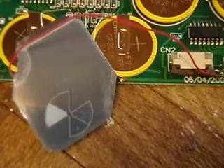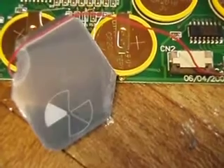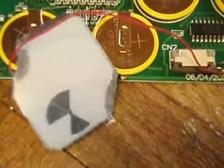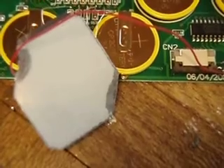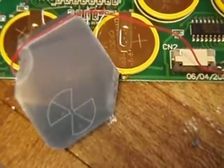Once you scrape that away you've actually got access to the contact area itself. I've hooked up a wire using silver paint there, and the other three contacts on the back for the other three segments are just silver painted. This technique will allow you to have up to 11 independent segments on the car display, which is very useful.